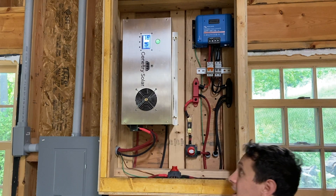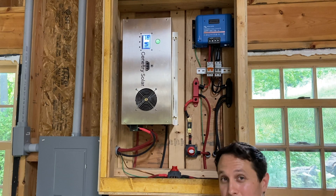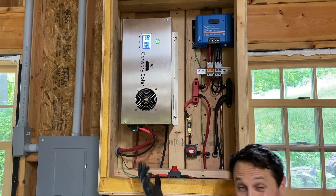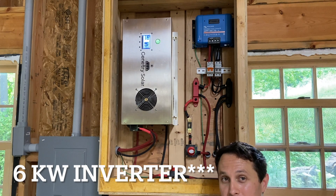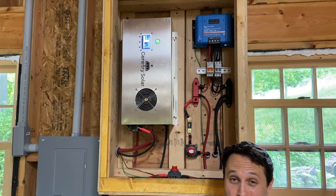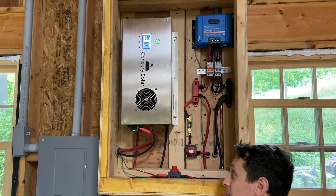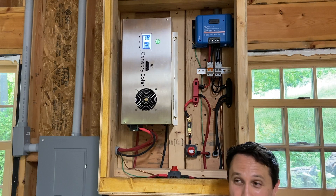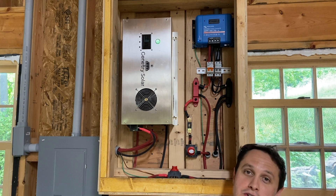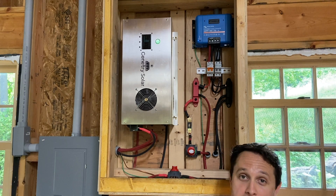That's my system and I'm pretty happy with it. I have to cover things up, I might add some airflow and maybe some heating pads for the battery, but it's a pretty simple system and I think it'd be very easy for other people to replicate. At the same time it's a big system — I've got 14 kilowatts of storage and a six kilowatt inverter, and yet it really wasn't that hard to put together. This system I'm using to power things like circular saws, dust collectors, dehumidifiers, and even an air conditioner because it's just too hot in here. I can handle all that with this system and roughly a three kilowatt solar array. I'll post links to everything below — please post your questions or comments, I'd love to hear what you think. If you have suggestions or if I made a mistake, please post in the comments below. Thank you guys for watching.